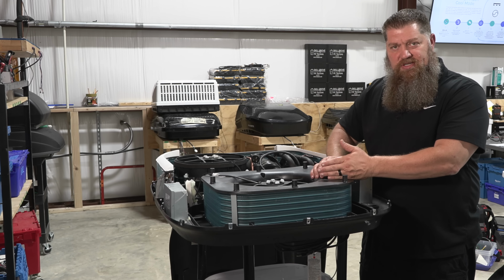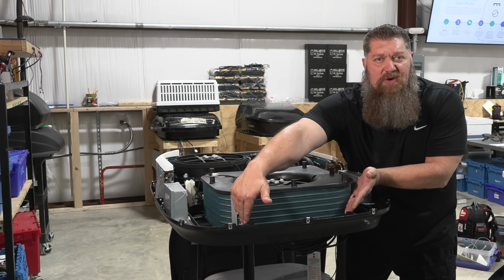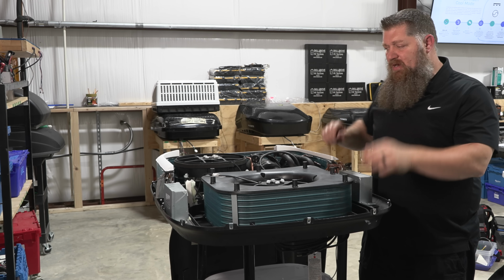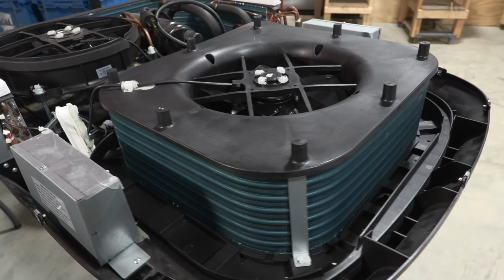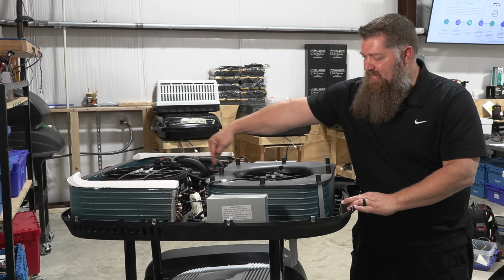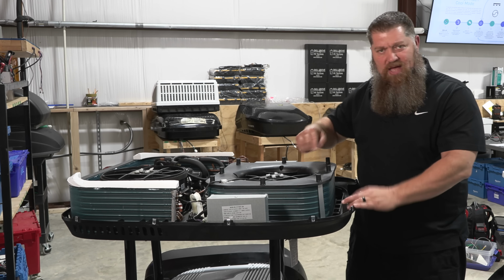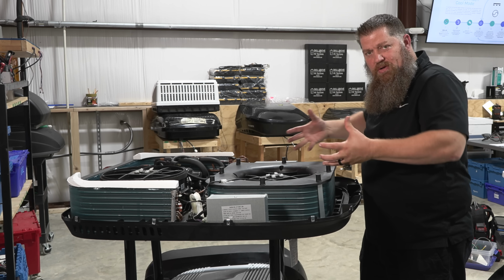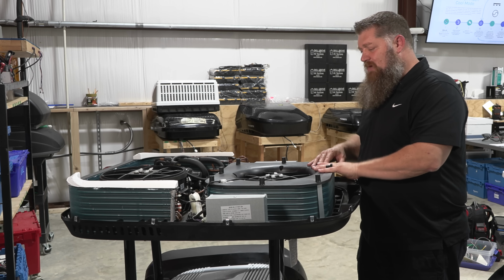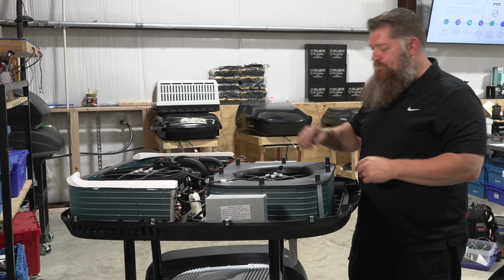Most of the air conditioners that we have on the RV roof only give us this much space right here. I have a flat set of coils that go across. If you look closely, these are basically designed in a 360-degree radius. I mean, not only just from the sides and forward, but also all the way around. They have curved the coils all the way around. The airflow itself, as you saw as I took off the upper plenum, of course, comes up and envelops all the way around and back in.